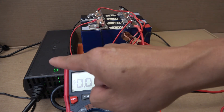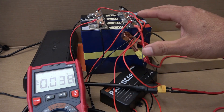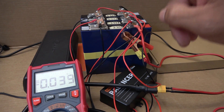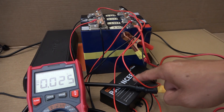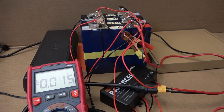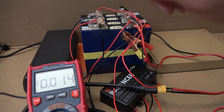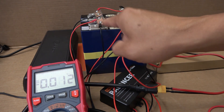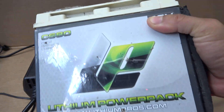To sum up: should you charge the battery with a balancer but without a BMS? The answer is no, absolutely not. It is very risky and dangerous to charge a battery like this. It's not the balancer's job to balance your entire pack while charging. The balancer is just for balancing all your cells when you're not charging. You will need a BMS to charge your battery safely — not the balancer. And this is why so many of these batteries fail.